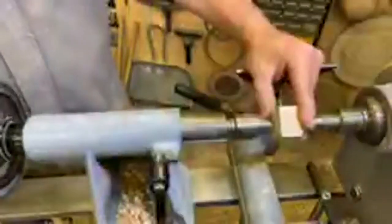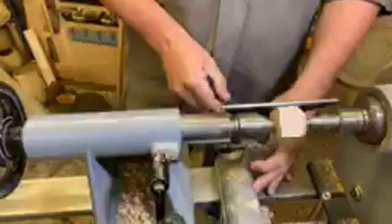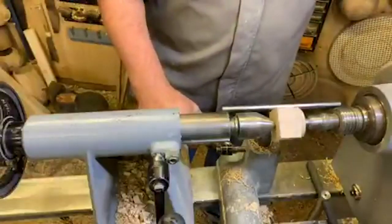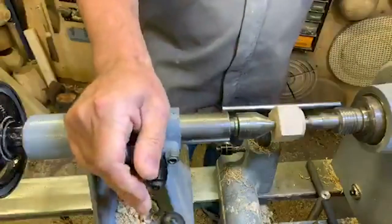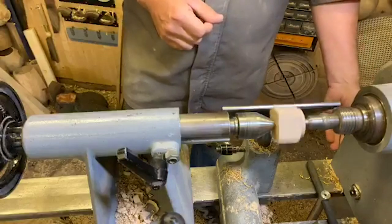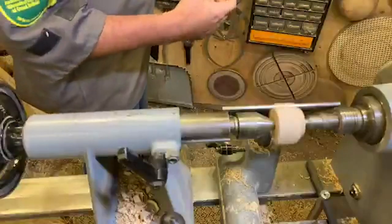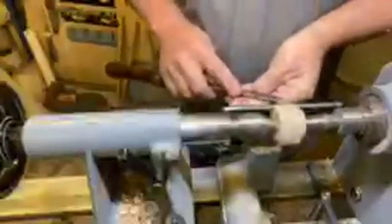The only issue I have, I'm not a fan of thread adapters, and the reason being, if you use a thread adapter, that's another two faces that are touching each other. So every machine face that touches another, even though these faces are done on highly accurate CNC machines, is another face that could throw in potential error. And it throws the whole thing further away from the headstock, all that sort of stuff. So at first glance, no, but if you can avoid it, do.